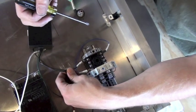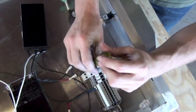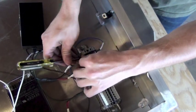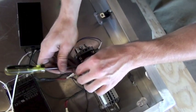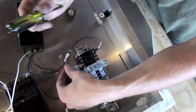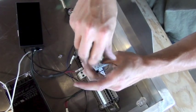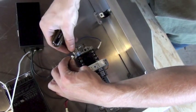The 12 volt transformer provides power to the relay so it can perform its functions and protect the vehicle from being operated while the charge cord is plugged in. We have three relays in our system: the charge relay we're addressing here, the timer relay right next to it on the DIN rail, and a reverse relay in the corner of the box that we'll address later. After attaching these two wires, we'll make a connection to the timer relay.